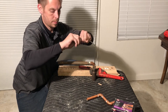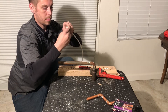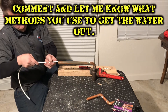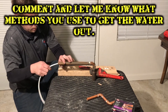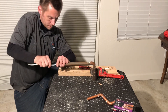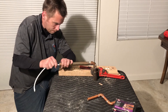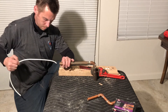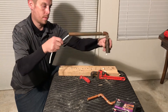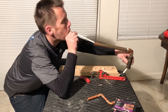It's smart to follow that natural curve when using this method to evacuate water from a copper pipe, especially when going down a horizontal pipe to reach the vertical that feeds it. Every horizontal is fed by a vertical — if it's not, go downstream and find the meter. As you can see, I've fished my line down through that pipe.